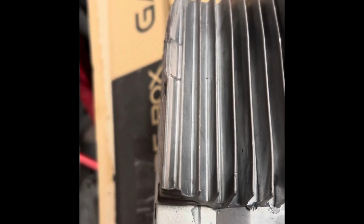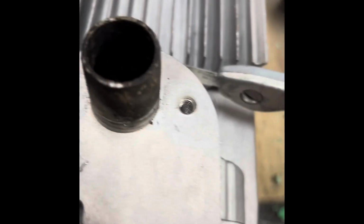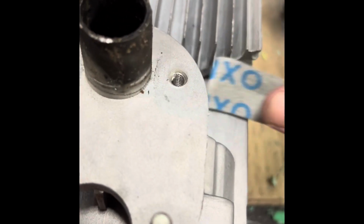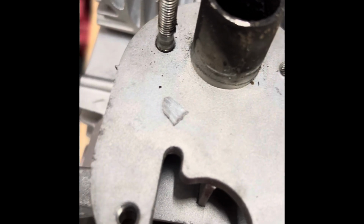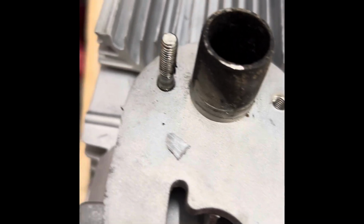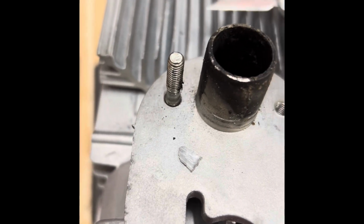Okay, so I'm still taking the moulding flash off. See, there's a big chunk of it there. That's a lot, isn't it? But is this the cause of it not choking up? I'll soon know, won't I? There is just so much metal there. Now, if it does start coking up, what I'd know to do in future would be to block off this bottom half here, so the air doesn't travel across, the heat doesn't travel through the fin at the bottom, and by not travelling through the fin, the fan is not cooling itself down and causing this exchanger to get even hotter.